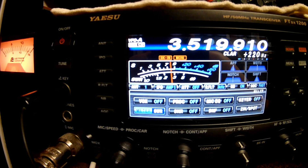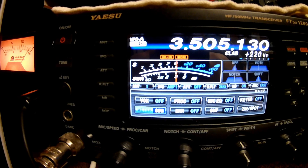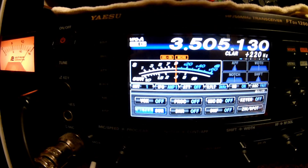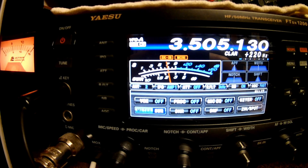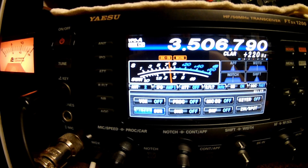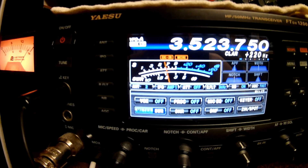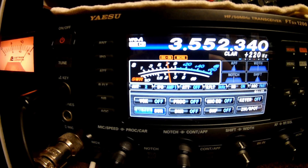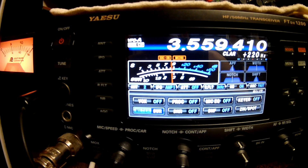Let's try the lowest part of the band, somewhere around 3500. That's the wrong antenna — there we go, antenna number two. It's just under a 3. I can wind it up to 3525 and I don't think it's going to get much better — maybe 2.7. Going up to 3550, still 2.7. It's usable, but a little on the high side.